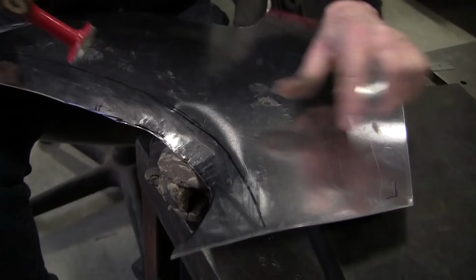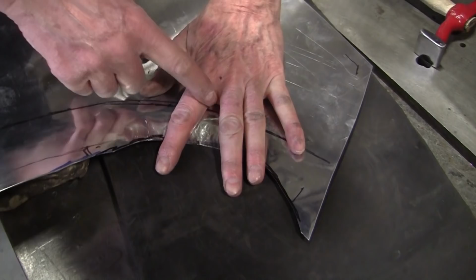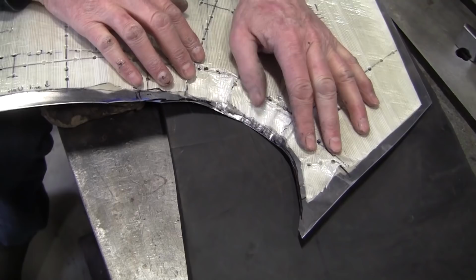But we need the flexible shape patterns to monitor our progress on that stretch of that flange. You see where all the stretching is going to take place, it's this triangle. So it's very little here, but it's got to open up like that, a triangle. All right, so we still have a long way to go here. That's a lot of stretching. So we'll try that clay. I like the way that felt.